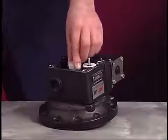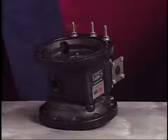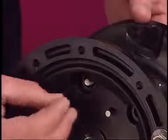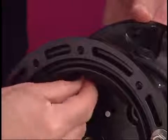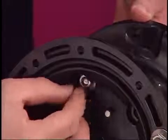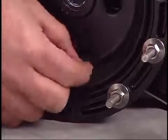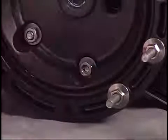Install the connecting rod bushing. Install three screws into the front or air motor side of the second air cap. Carefully place the second air cap onto the center body. Place a new washer and O-ring onto one of the screws, carefully insert it into the air cap and through the center body, then attach an O-ring, washer, and nut to the screw. Tighten enough to hold the air caps and center body together. Then attach the remaining O-rings and washers. Apply Loctite 242 to the screw threads before attaching the nuts. Using the 1/2-inch socket, torque to 11 to 14 foot-pounds or 14.9 to 19 newton-meters.